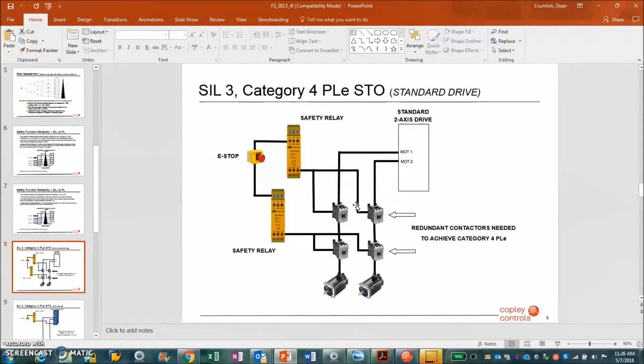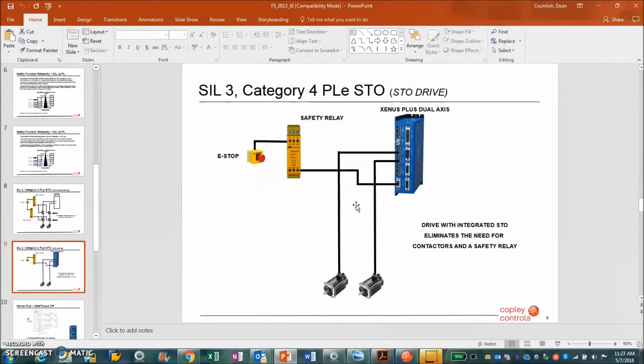Today there are a lot of relays placed between the drive and the motor to keep the system safe. The idea is to reduce the number of relay contactors between the drive and the motor and keep it simple. This is purely a safety switch with a safety relay connected to the STO output, which disables the drive and disconnects the H-bridge from the motors, so you no longer need all those excessive components for disconnection.